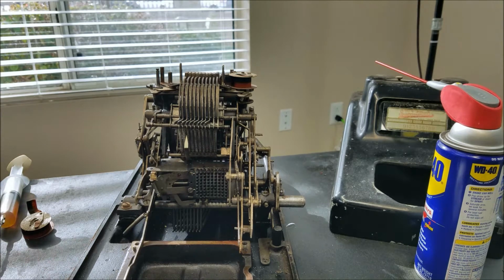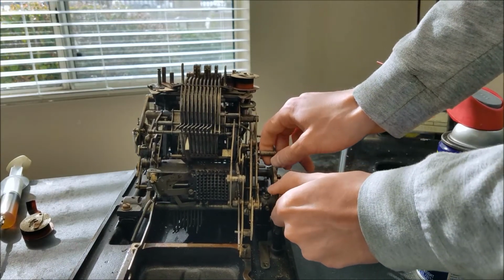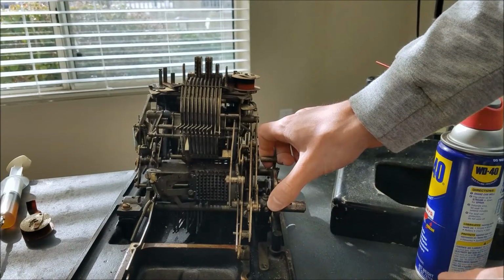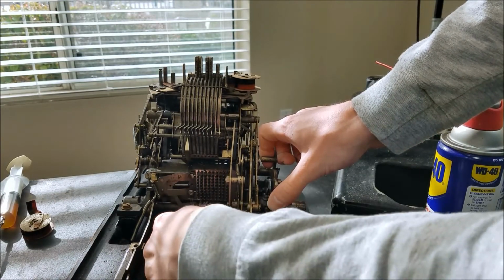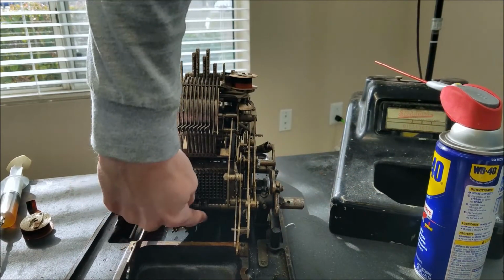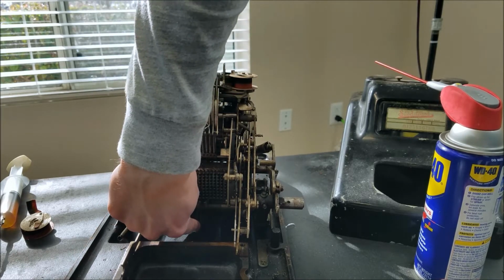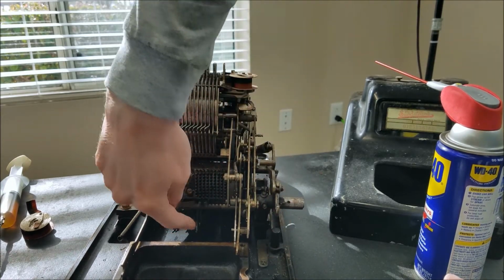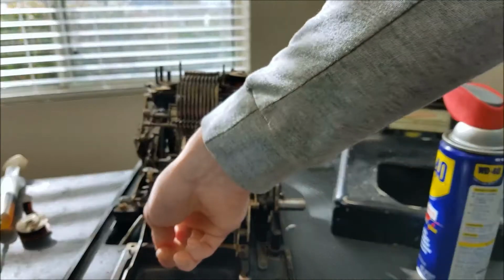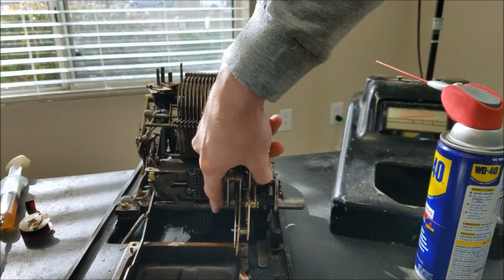And then if I run the machine through a cycle, you can watch those. Well, some of them are raising up. Not quite sure why those are raising up. They shouldn't be. But if you watch the 2 here, as you can see, this one went so far and stopped, and this one didn't go up at all because it was stopped by the bottom peg. This one raised up until it was stopped by that middle peg. Not quite sure why these other ones went up. They should not have, because those should be blocked since this wasn't over far enough. So I'm going to have to take a look into that.